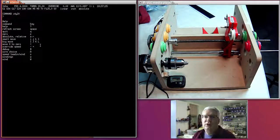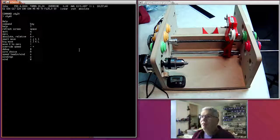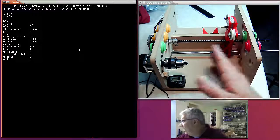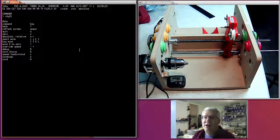Let me show you another feature of GRBL 1.1: real-time feed overrides. In the help screen you can see the override speed is plus and minus. So I'll command X0 Y20 — moving the axis back to zero while rotating another 20 turns, basically another layer. While it's running I can exercise the feed control with plus and minus on the keyboard to slow it down or speed it back up in real time.